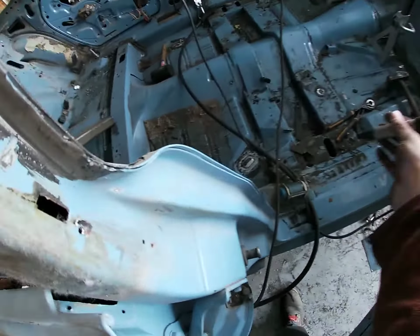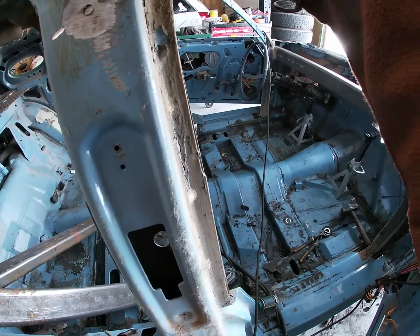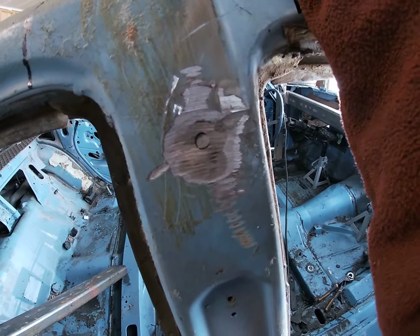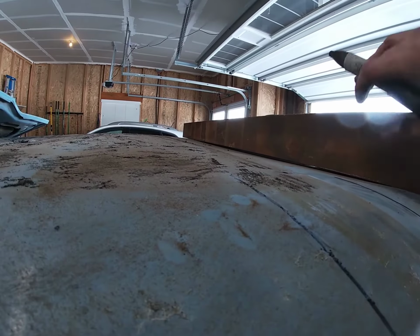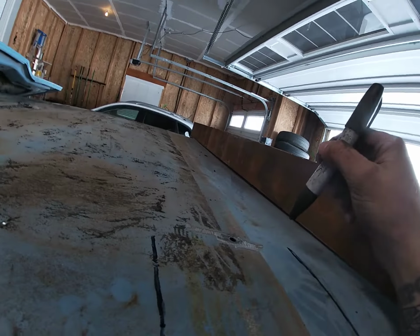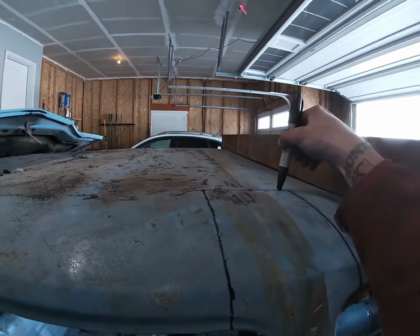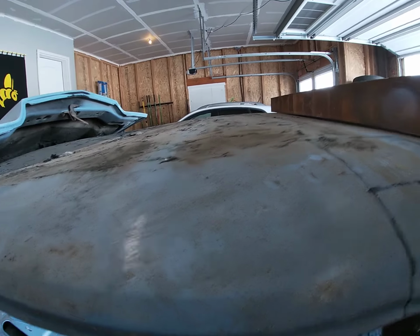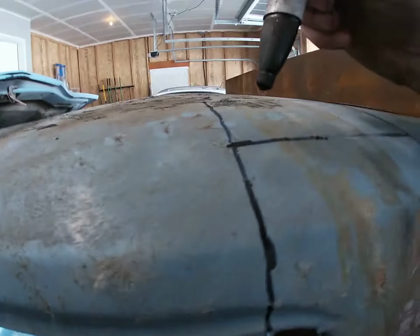And then that goes right to the seat belt, which is right about here. There's a little piece on the inside, kind of like two little cross pieces. We're not going to worry about these. They don't really add a lot of strength, and we're allowed to bolt or weld our roof to our halo bar. So these really aren't a big deal for us. So what I'm going to do here is take it right to this hole, and then I probably want to take it right about here, which will allow us to slide in our piece here, which should be good.